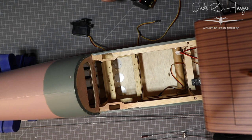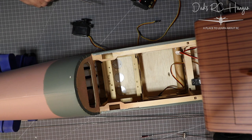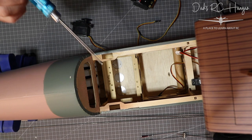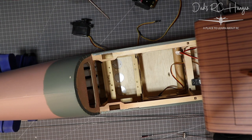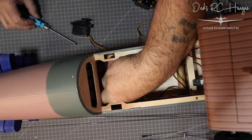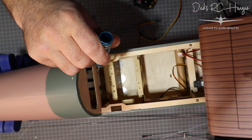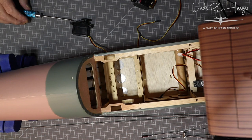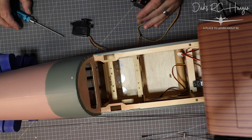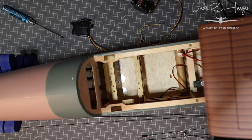As you can see, there are holes that get drilled for you, and that's where you're meant to put the servos - which is fair enough. The trouble is they're in the wrong places. You've got the elevator pipe that I've trimmed down, and then the rudder pipe. Now these three are meant to be over this side according to the manual, so I've got to move the servo. You can see a world of pain having screwed them in before.